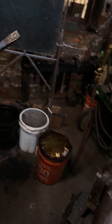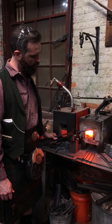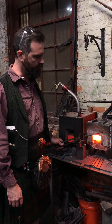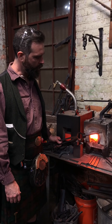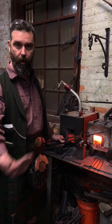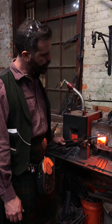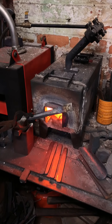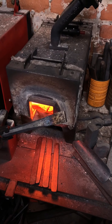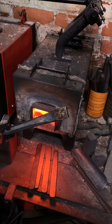I'm going to give it a little heat from back here — I'm just using that flame that comes out the front of the forge to catch it. You can actually put a piece of hot steel underneath it as well to help draw that through. That's a cool technique where you sandwich a piece between two hot pieces to create good spine heating on objects, or you drop a hot drift into the eye of something if you want a nice soft eye region on an axe. It's coming in well. This is a slow laborious process so don't ever rush it.